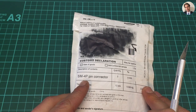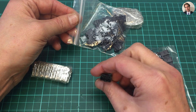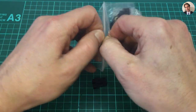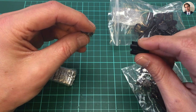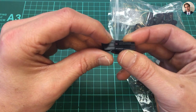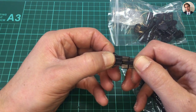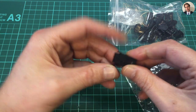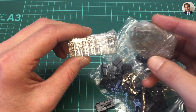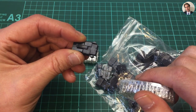Next up: SM 4-pin connectors. I don't know what they're called — maybe just SM is how they're referred to. These are used a lot for LED strips. If you've seen my 5th December postbag video, you would have seen I received some 4-wire cable, and that's for these. They plug in like this — that's a pretty decent connection. You also get male and female pins that you just have to crimp together yourself. Very handy.